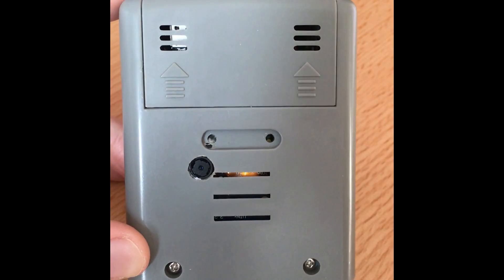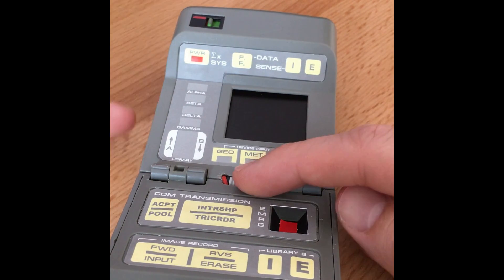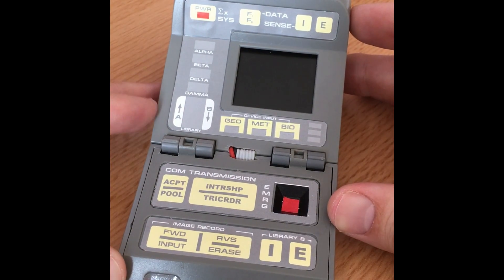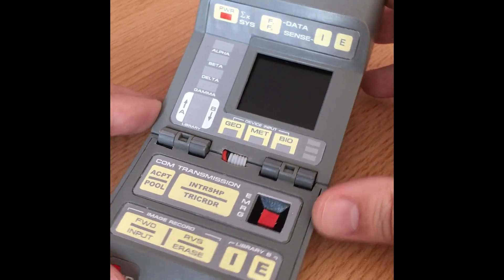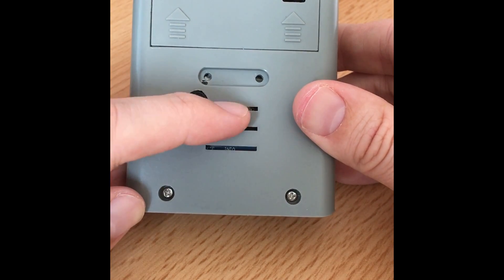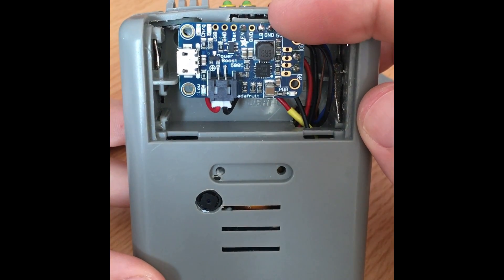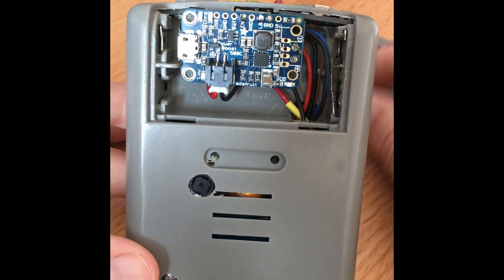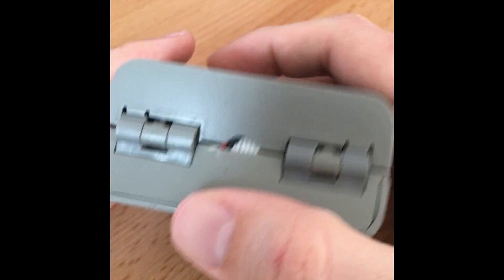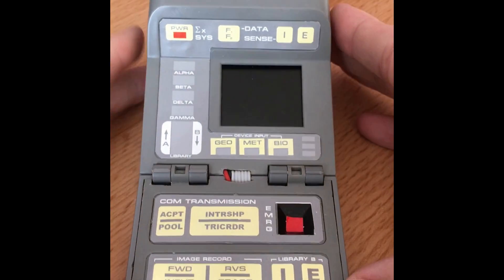You might be thinking, what's so special about this? It looks like the Playmates toy with maybe a cable in between, and there are projects out there on the internet with LEDs that light up the tricorder. But I've taken this one step further — inside this tricorder is a Raspberry Pi. The camera is a Raspberry Pi camera, and there's a power boost circuit connected to a battery powering the whole thing. That's what the black and red cables are. So we'll power it up and see what it does.